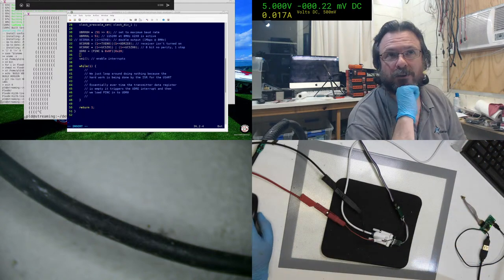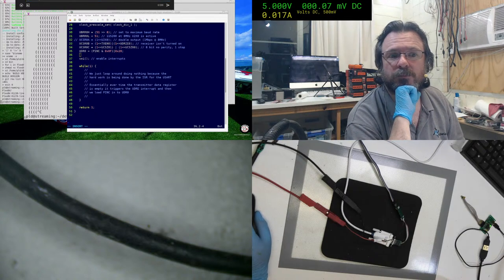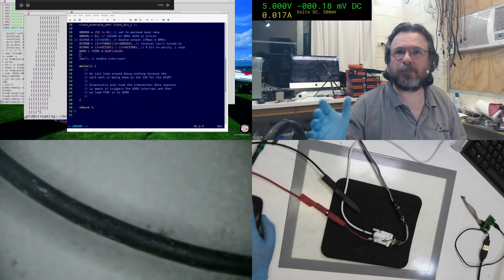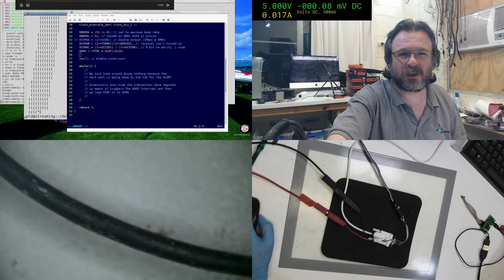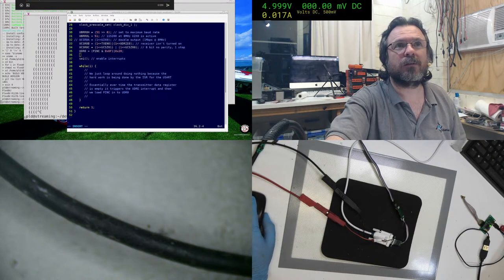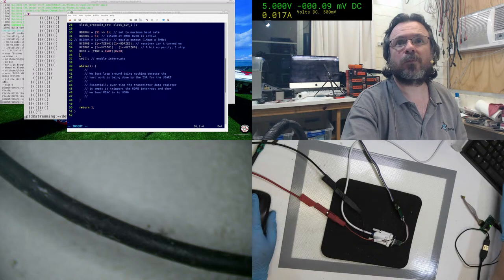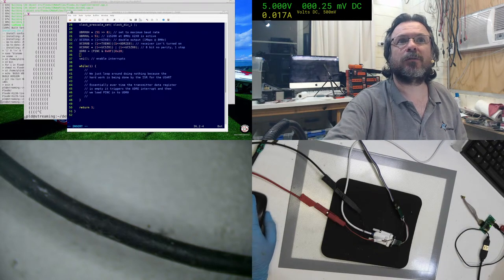I should just print out the data sheet again one day. So it seems like it's not pumping out the data correctly. It's not shifting the shift register, or we're getting multiple transmissions of the same data. I'm just looking at the data sheet at the moment.